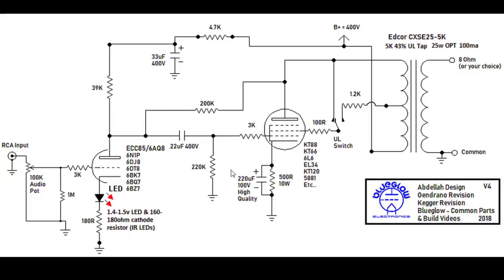So now that I've said all that, sorry for the break away from the bench, but I just thought it was important to help you understand. The reason being, we've got to go test some LEDs now. Even within a bag, let's say you bought a bag of 100 LEDs, you might find variances within that bag. You might find some at 1.38 volts, one at 1.52, but you're trying to find one around 1.4 to 1.5, so you may have to test a bunch of them to get what you're looking for.